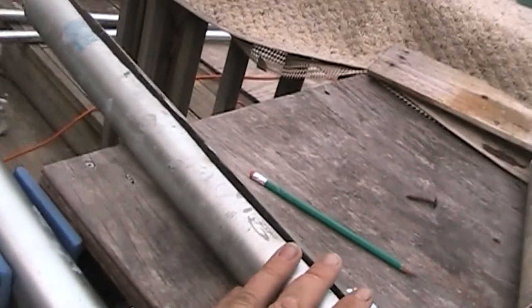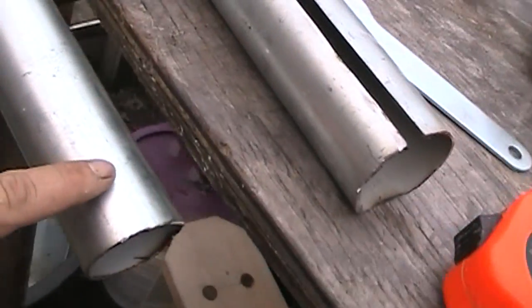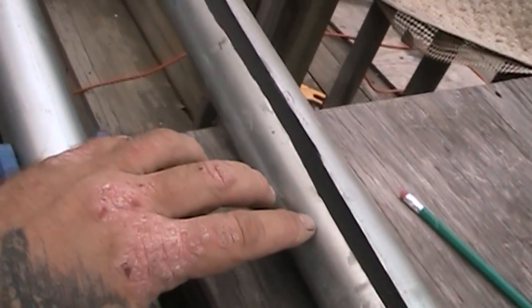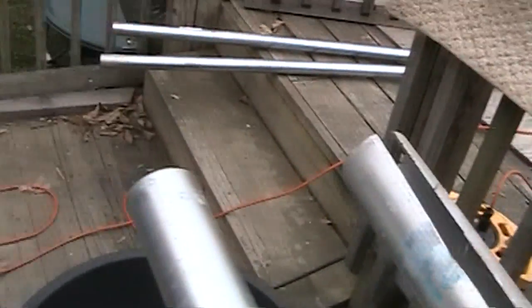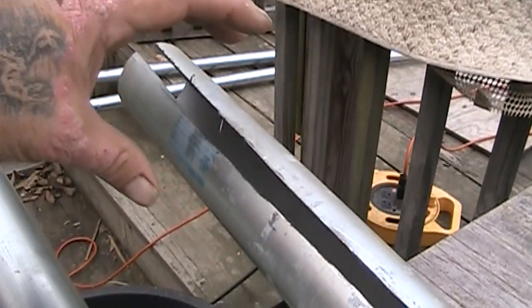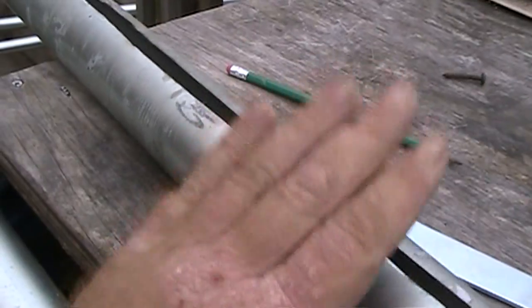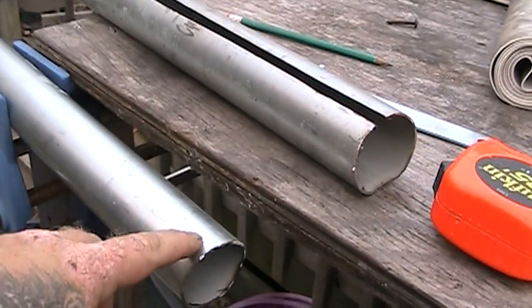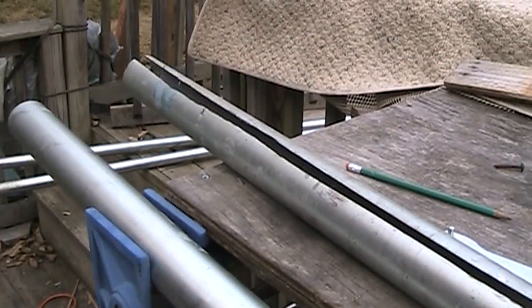Here's what we're doing. We got some two-inch conduit, a little bit bigger than the inch and a half stuff. We cut a two-foot section with the grinder, and on the side of the conduit there's a little seam from the manufacturing process. I just took my grinder and ripped it down about a half inch gap or so. The plan is we're going to slide this over the two inch-and-a-half pieces, put some U-bolts on it, and clamp it down tight around the inch and a half. Once it's tight, we're going to drill through it and bolt it together — we'll make our own coupler, since we need a longer, stronger one. The only tool we're using is the angle grinder here, with the pipe in the vise.